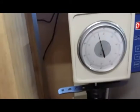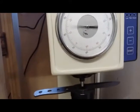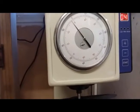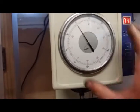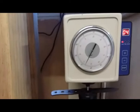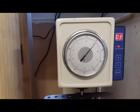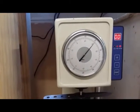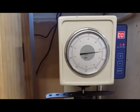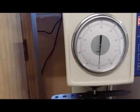The first one, I've got one on here. This is going to be a hunting knife, so I'm hoping for approximately a 60, which is what I've tempered for. It's always a hope. Dial and away she goes, and as always, fingers crossed. It's probably the first time I find out if anything's not working right. At least you can always repeat the heat treat. I think I'll be happy with that.